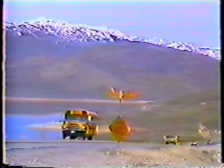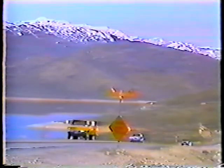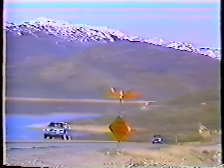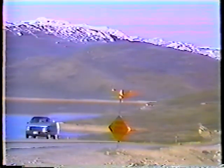By placing the signs extra far apart, people tend to forget that they've been warned of the road work ahead. This is especially true when the road you're working on has a lot of curves or hills — if the motorist doesn't see you soon after the sign, the message will be forgotten. So keep the signs close to you, even if it means moving them several times a day.